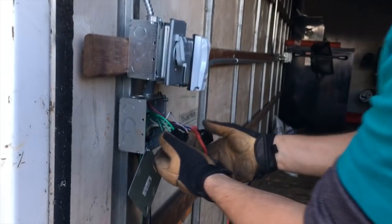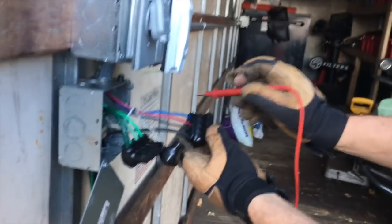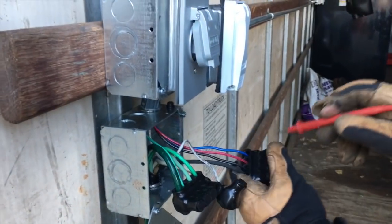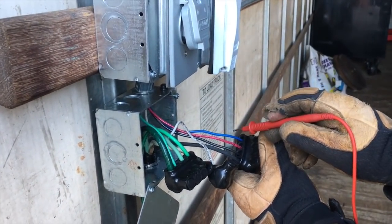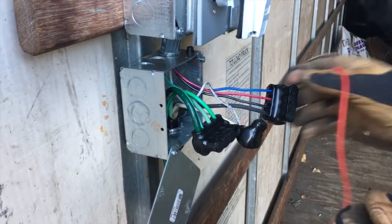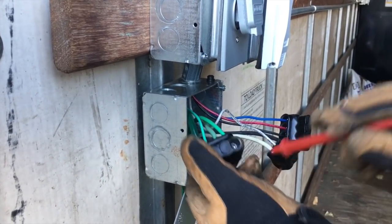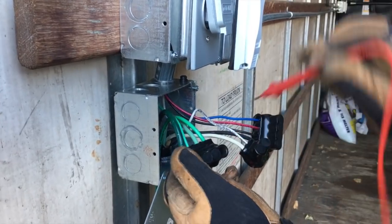Right here is how I joined everything, so later on if we want to break this off, we can take off this four-port Polaris connector and take off blue, red, and black, divide that up, and add a couple more cords in to have separate circuits. They don't need that right now. The neutral can be added later to a three-port if needed, and then the ground. I like these ports because I can test power as I'm working at the end of it.